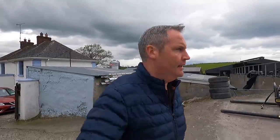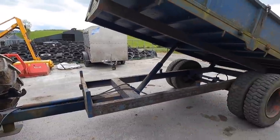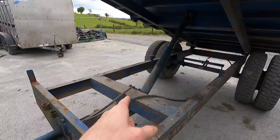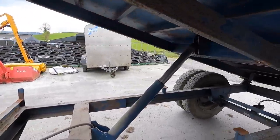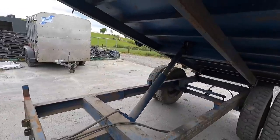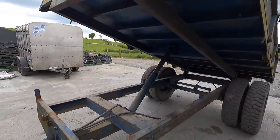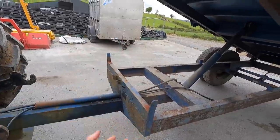Next little job we're going to tackle — something that has to be fixed and addressed, because a simple problem could turn into quite a big and dangerous one. On my trailer — I'm just at the tip of it up here, I'm not going under it, just so I can show you guys what I'm going to be fixing. You see the ram goes up there and up to a pin, and same down here. Well those two pins are very, very badly twisted, on the point of breaking. If you were tipping a load and that pin broke, it could be a pretty bad hop — could even wreck the trailer, it's pretty dangerous. So I've got two new pins for it. It's not going to be an easy job because of the twist on it. I'm going to drop the trailer back down, put a couple of wedges to keep it slightly up so I can get in underneath more comfortably.